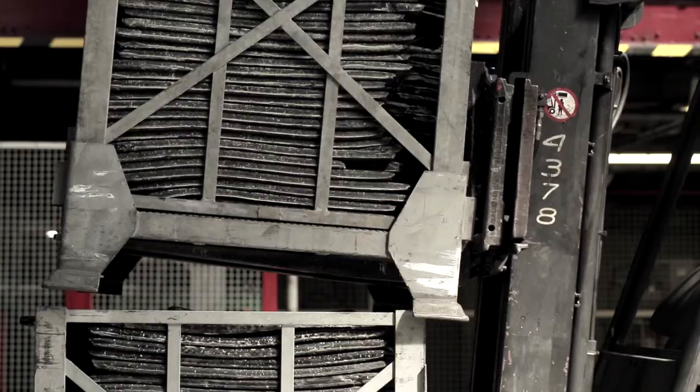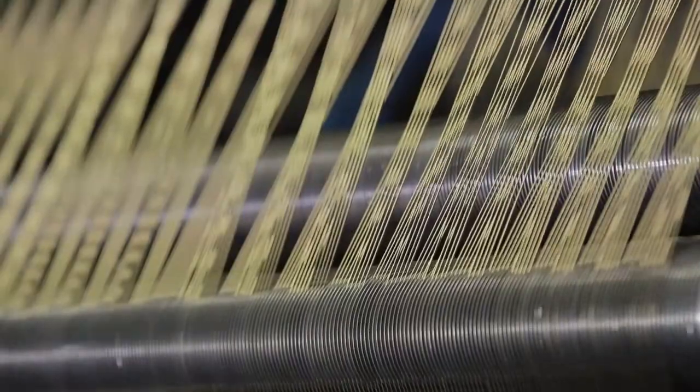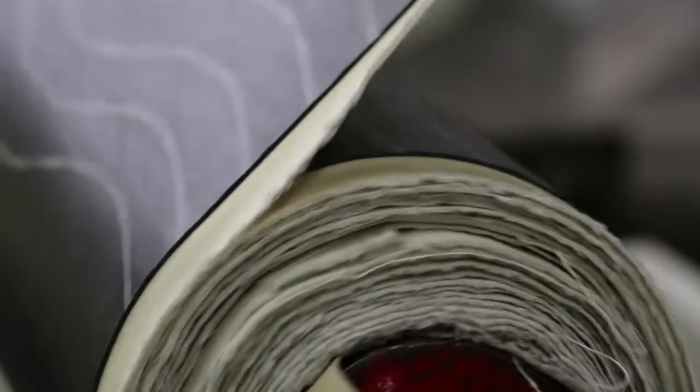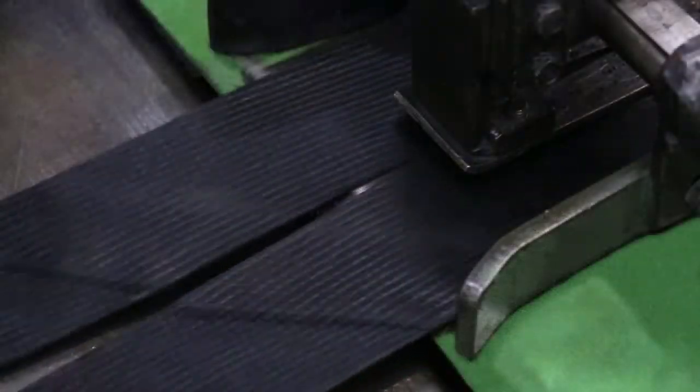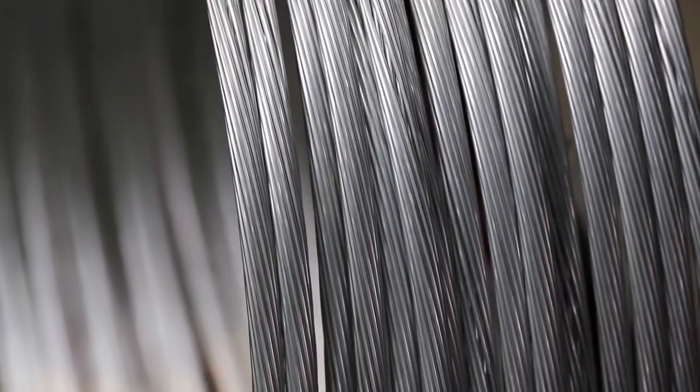The tire is also made up of long metal cables and textile cords made of aramid, nylon, etc. to withstand the significant stresses to which it is subjected, the first being inflation. Once these various components have been prepared, they will be transformed into a multitude of elements. Flat products, shaped bead fillers, metal or textile wires, as well as bead wires.